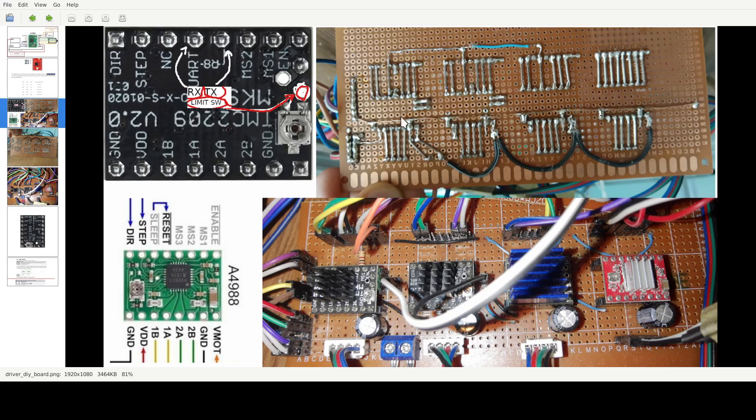I put this ground line here and it's connected — as you can see — to the first pin and the second-to-last pin, because the grounds need to be connected together. This is the same on all four drivers. The four connections to the motor are just straight lines on every one. Then you have to put a capacitor between the power lines for the motor — connected here, as you can see these two points on every driver.